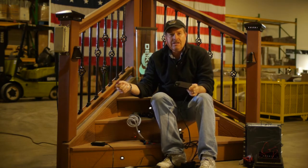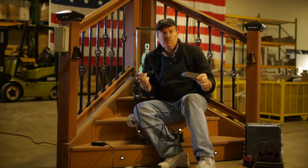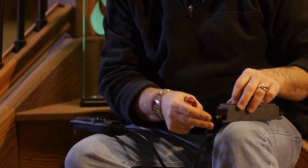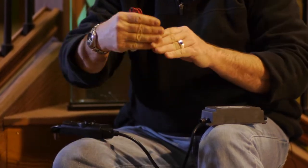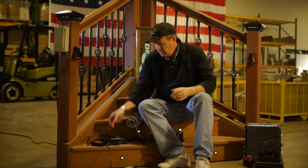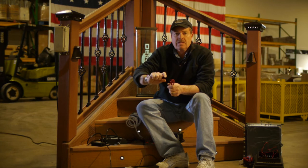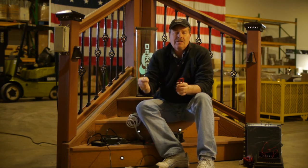If you cross the wires, you're not going to hurt anything. The lights won't light, but you're not going to hurt anything. The transformer will reset up to 20,000 times — at that point it does give up, but you're not going to exceed that. So if the lights don't light, chase the voltage. Always chase the voltage. Make sure you've got power at the outlet, and that the light on the switch is on and that you've got power coming out of the transformer. Just take one of the lights and attach it directly to the transformer — that's going to tell you if the transformer is good. Then it's just a matter of following that circuit down and finding where the problem is. It can be as simple as one connection where you're treeing into the main bus wire, or a loose wire nut.